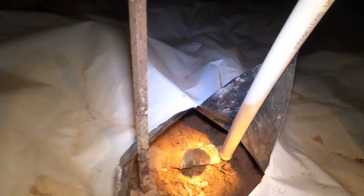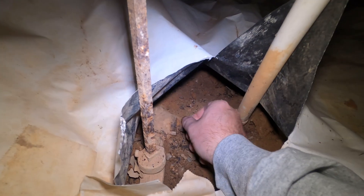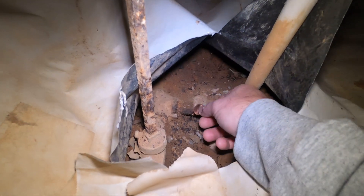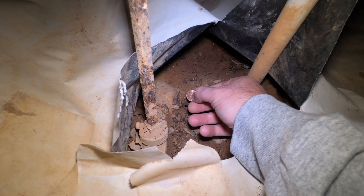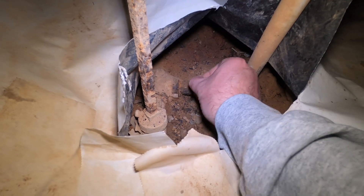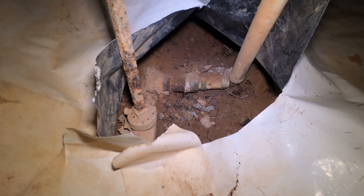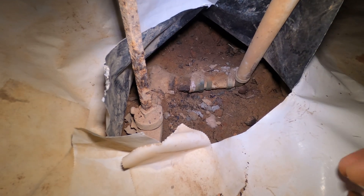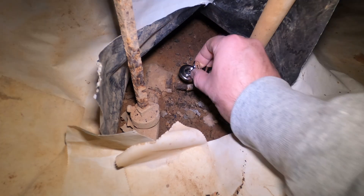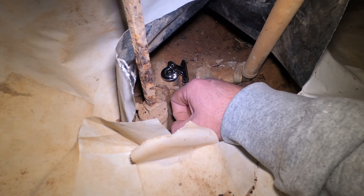I realize I'm rambling a bit here. Okay, so this is the main line. I found the main line, I scraped it. It looks like the pipe isn't shiny underneath this corrosion. I'm scraping with a copper-colored penny and the pipe isn't shiny, nor is anything white flaking off as I scrape it. So it's probably not lead. Could be copper — copper is not magnetic, neither is lead. This is a magnet. Test it — it's sticking. Test there — it's sticking.